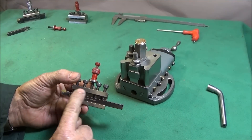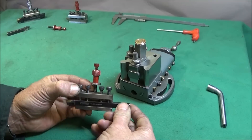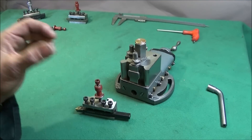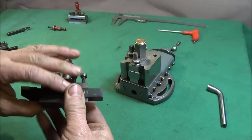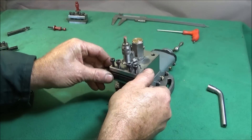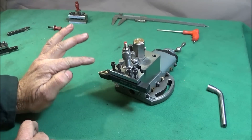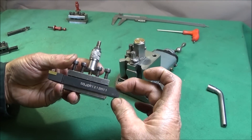All the ones I've bought recently are soft enough to mill. If you've only got a hard set of tool holders, it's best to just buy a cheap one off eBay and use it for this purpose. This is one that I've milled — you can see it has nicely removed that section. When this goes on the tool post it goes much further down, and I'm able to achieve center height on a 12 millimeter shank tool easily. There's still room to go down further, up to about 13 millimeter.